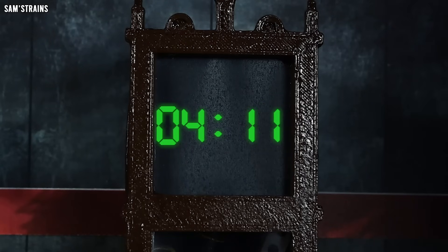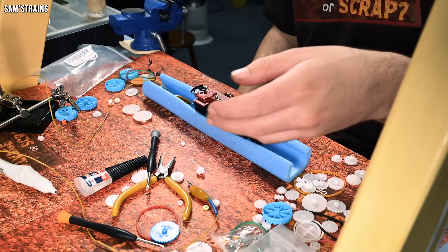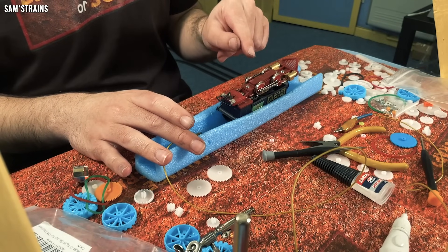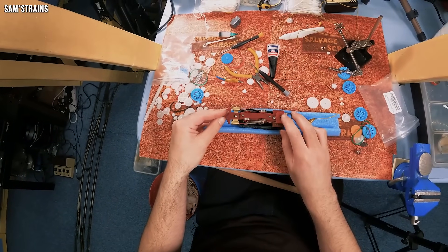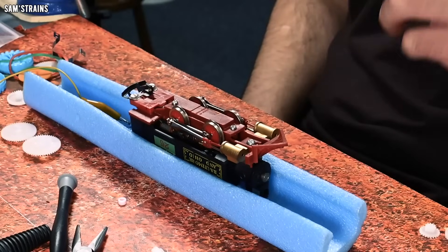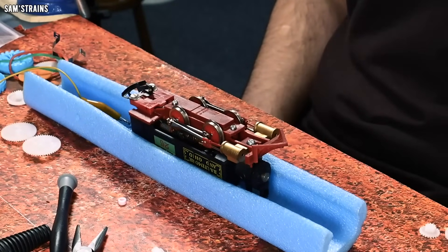Time-o-matic, please stop the clock - with four minutes and ten seconds remaining. I had a good go, I dug through my archive of gears, I tried to find ones that would fit, and amazingly I did. Those gears I put in I believe would work with this, but we've got a broken gear and a body screw that has failed. I'm going to take it through to the workshop, put power to it, and cross my fingers because maybe a miracle will happen, but I don't think it's going to be good news.